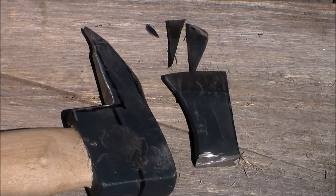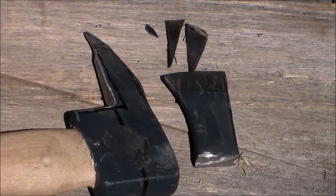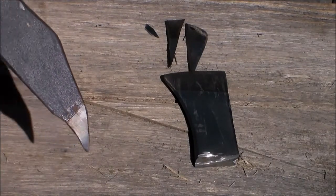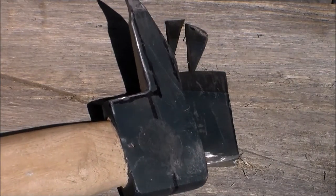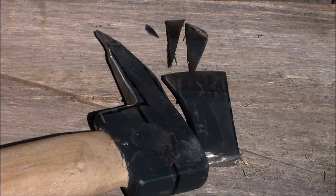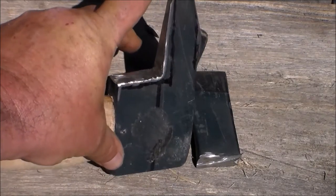It's a little shorter than what I usually use, but this is meant for behind the seat of my truck in the event I find myself without my regular PB 36-inch pick-a-roons. It's just a good tool to have around, or maybe I'll keep one on the splitter for handling up on the deck. At 14 bucks, I used half a cutting wheel from Harbor Freight — under a dollar — and not even a third of a DeWalt cutting wheel — under two dollars — so three dollars in cutting wheels total. Then I used a regular quarter-inch thick grinding wheel to round off the edges, remove burrs, grind the hollow, and sharpen up the chisel.